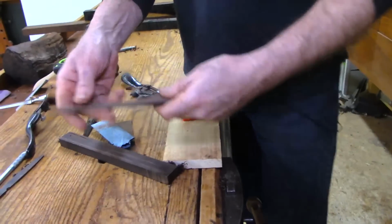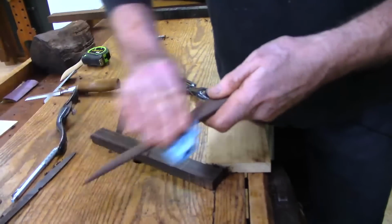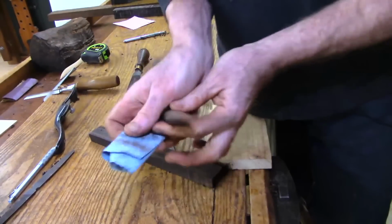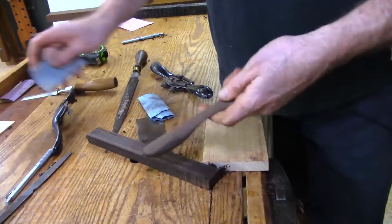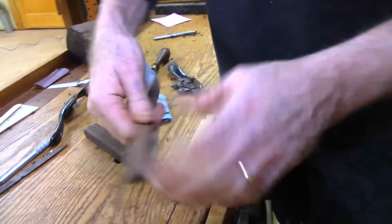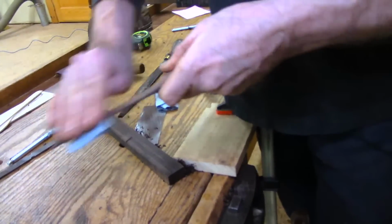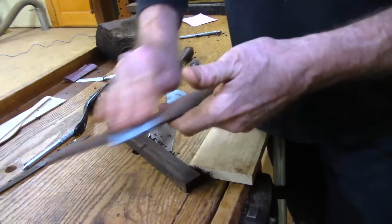Okay, I'd go over it with that. That pad gives you kind of quick work. And then hit it with 150. After hitting the whole thing, then I go to 220. And you start to see it. It's going to start to look a little bit polished because of the oils in it, similar to ebony.